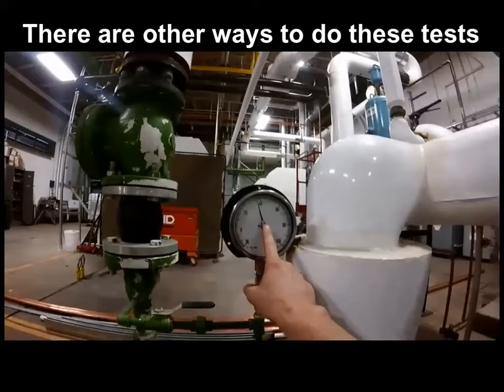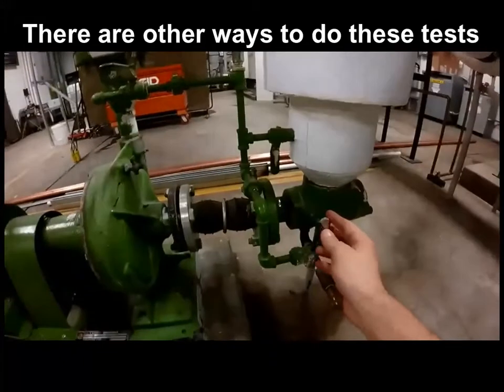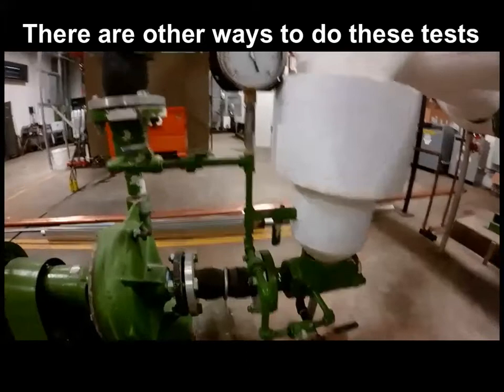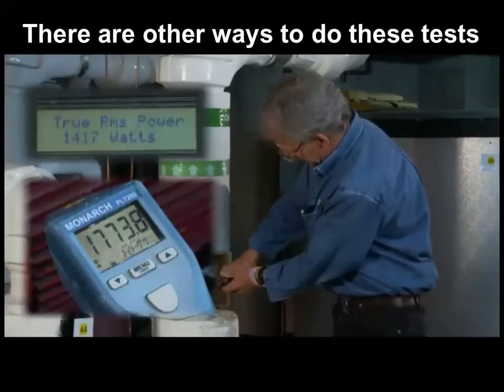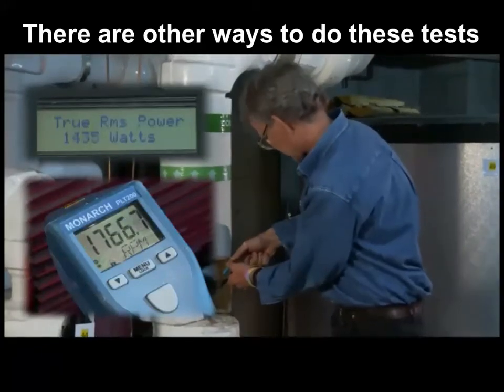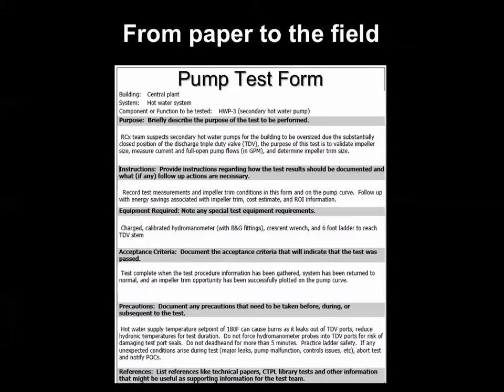If we had something like a single high-granularity gauge valve between the suction diffuser inlet, pump inlet, and pump discharge, this would have been an easier way to run our pump test. If you're interested in seeing additional approaches, check out the video by David Sellers, where he uses a stroboscope and power KW meters to illustrate how pumps load and unload during these tests. Hopefully this has provided some insight into how we create and execute functional tests to understand what our systems are doing and how they can do it better.